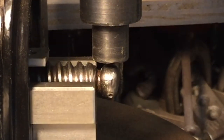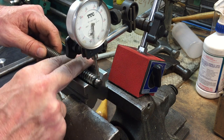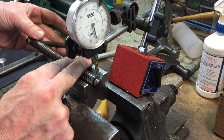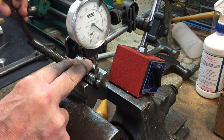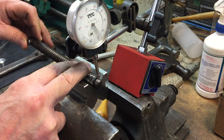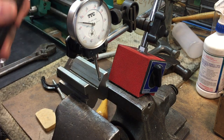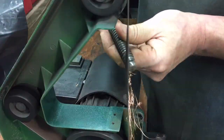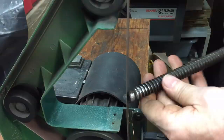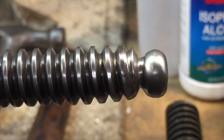We're going to take all this apart and see how much it deformed. I can see it did move down a little bit. Back at the setup — remember how much of a deflection there was? We put it in and we can see we took a tremendous bend out of that. We're only at about 20 thousandths or so, and some of that is just the material — that's really good. We took a lot of that out; it's pretty straight. We get it well within specs. Now we're going to make the little pad.